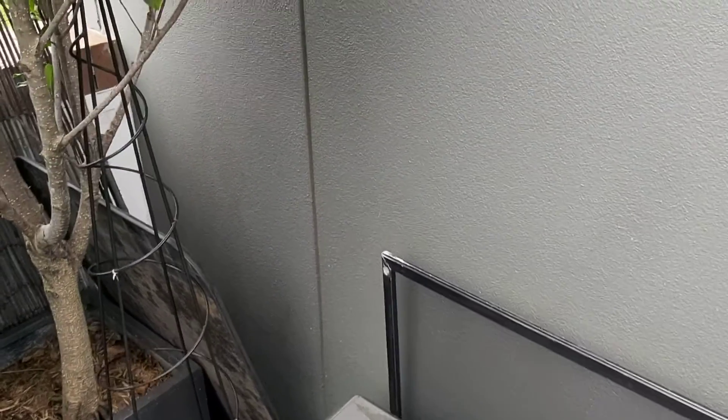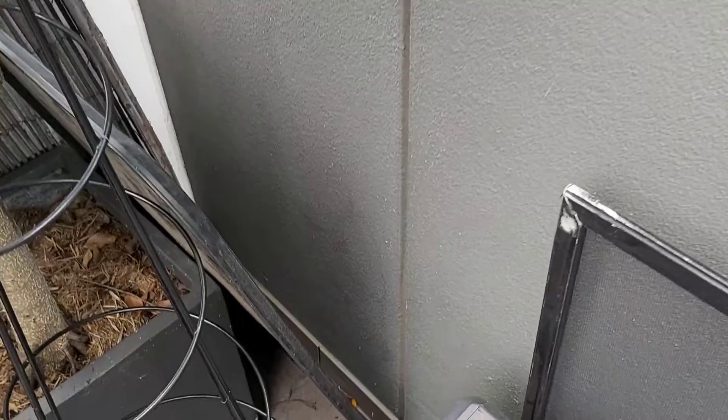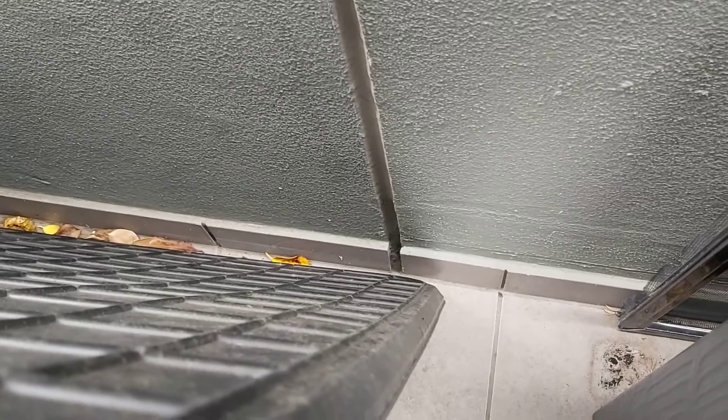Unit 79 Colson Street water leak, main bedroom. There's what appears to be a structural column, and the water is leaking in that corner into the main bedroom. A new cavity flashing has been installed historically up to the column, but no waterproof membrane bandage has been put at the wall-floor junction.